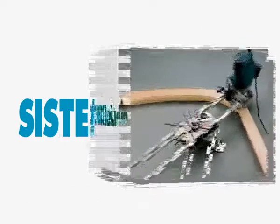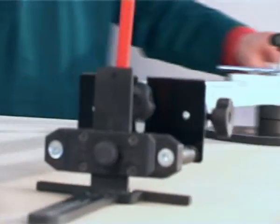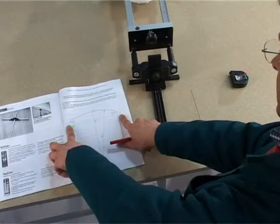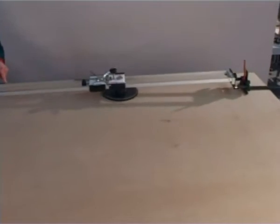Arcade Zinco Elix: the only equipment on the market capable of producing single, double radius arches or elliptical frames. This equipment makes it possible to produce any curved elements without the need for templates. The minimum working radius is 13.5 cm, while the two pairs of supplied bars can be used to achieve a radius of 3 m. Additional pairs of bars can be used to increase the radius by 1.5 m for each pair.